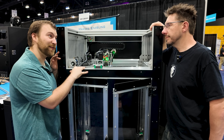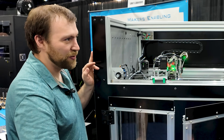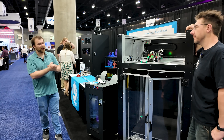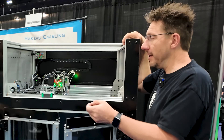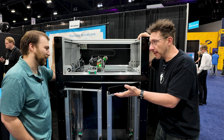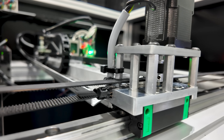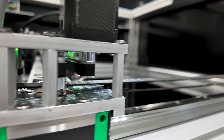This is actually probably the smallest platform that will be offered in the StableBot Pro — a 600 by 600 by meter build volume. I'm intending to offer up to about 2 meters of width. A lot of people told Elegoo they were wrong by not using CoreXY, but CoreXY doesn't scale. These are 12mm belts on here, and they're almost too small for a 600mm machine.